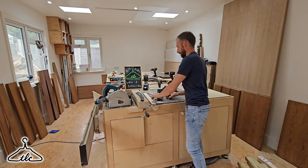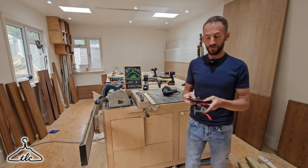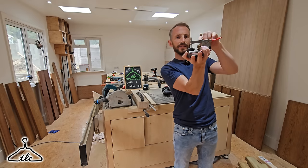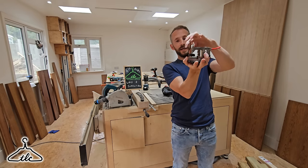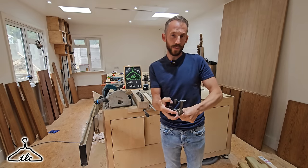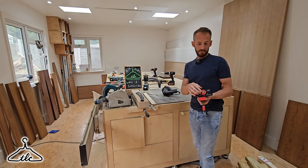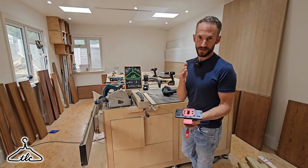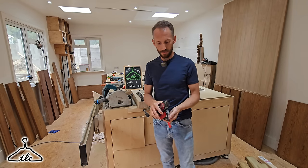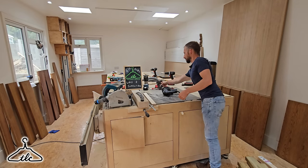The value for money on this is fantastic too. Remember, everything I'm going to be showing you is going to be in the video description. Adjust the toggle to whatever door thickness you've got — I've got it set to 18mm and there's still a good 18mm thread left, so I'm sure you can clamp it onto anything up to 30 or 40mm, but you're not going to need that — 18, 22mm maximum. It's aluminium, it's lightweight, and we've been using this for a couple of years non-stop drilling out hundreds and hundreds. It's quick — I think it's the quickest jig around — just because it's got the one-click motion. That's the Vico jig, which I really, really love.